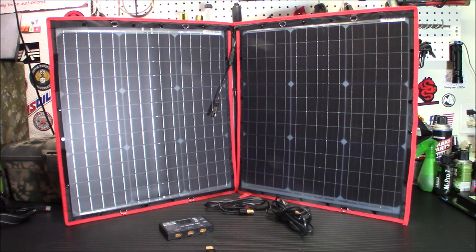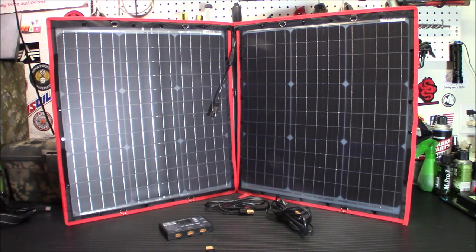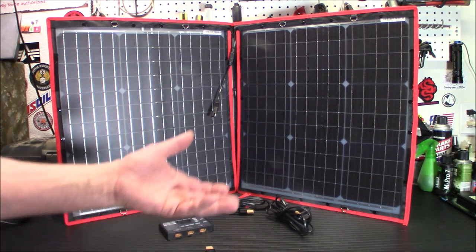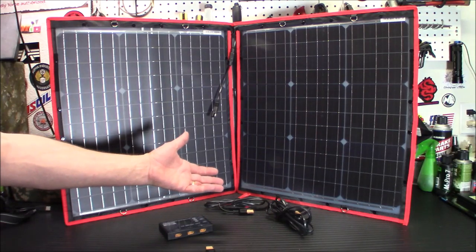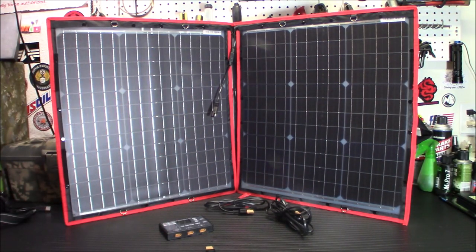The battery can be as big or small as you want — a little AGM, lead-acid, or lithium polymer type battery works fine. You can get a little 200-400 watt inverter; inverters have come way down in size and solar panels have come way down in cost. You can experiment with something like this, and as you see you want more you can add more, or keep this as a portable kit. This plus a deep cycle battery and a little inverter can keep you powered for an entire weekend camping, constantly being topped off by the panel outside.